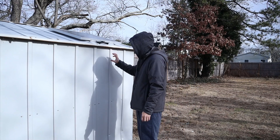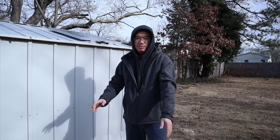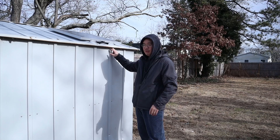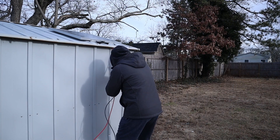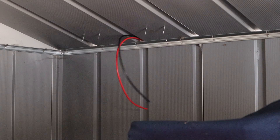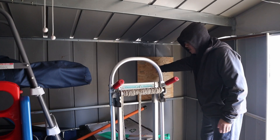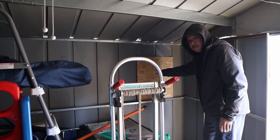For now I'm going to sneak the cable through here. You can actually buy a box that goes on the outside — you cut a hole and run the solar power cables through it properly — which I'll get in the future since I didn't know about it until doing this project. I put a little Teflon tape on the edge so it won't scratch the wire, and just in case it swings around in the wind it won't get cut. These wires are already pre-soldered so I basically just need to sneak them in. The plan now is to take this board and mount it up on this wall so I can mount all the solar components before running the cable to the rest of the spots.